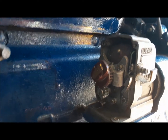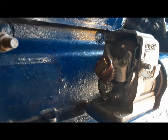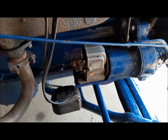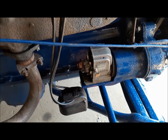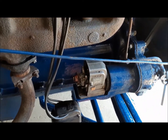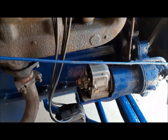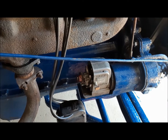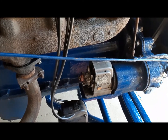Just verifying that it's timed correctly as per the manual — and it is. What I'm going to do now is, even though I hate what it looks like, try cobbling the distributor back onto this thing and see if we can get it running that way. At least then I can know either there's something wrong with the mag or something not wrong with the mag.